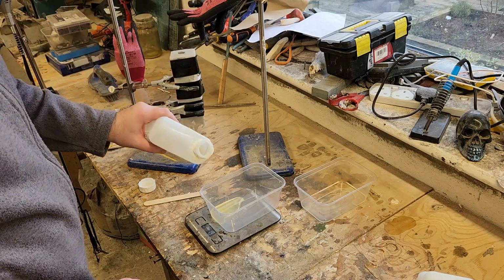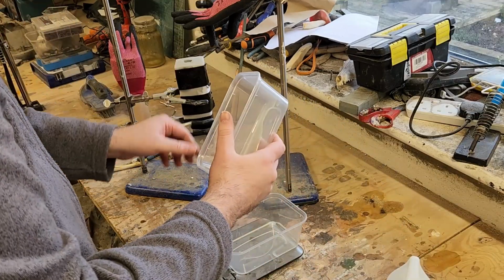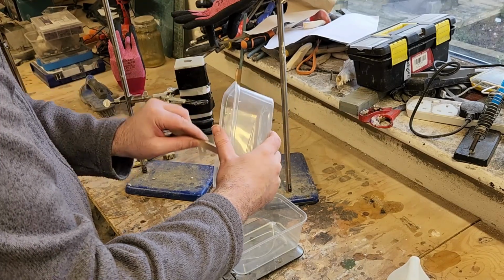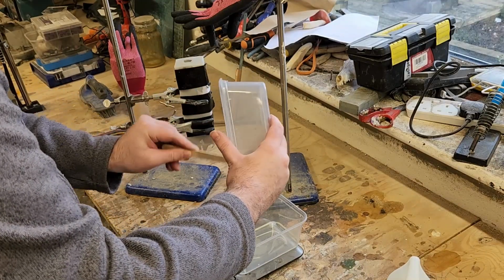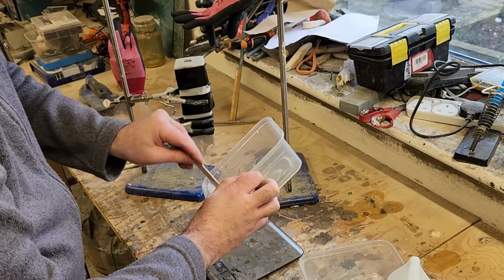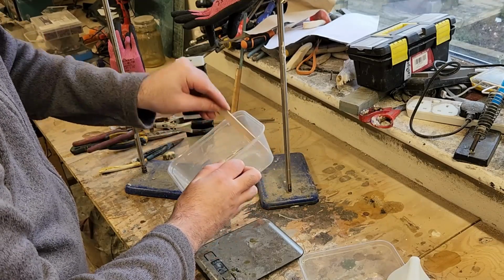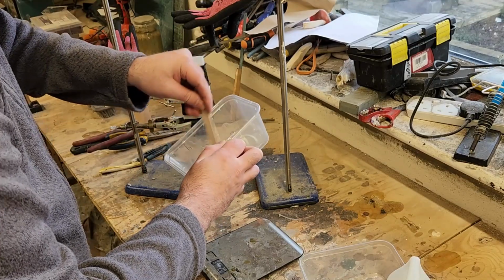Silicone molds are generally more expensive to make. They are better in that you don't need to use any release agent to get the foam to be removed from the mold, and they survive a lot better. I held the mold and the glove with clamps to keep it in place and made sure that the finger was aligned correctly.